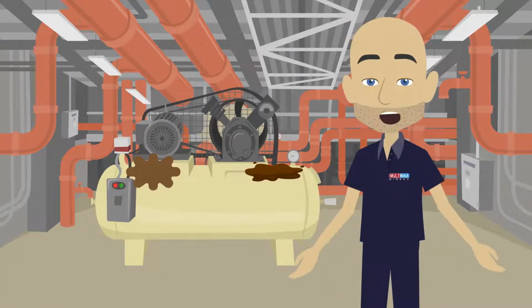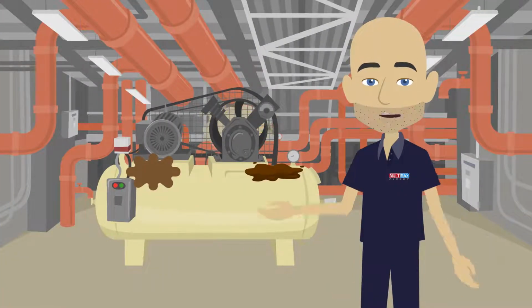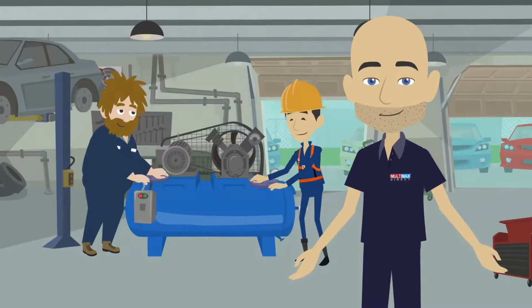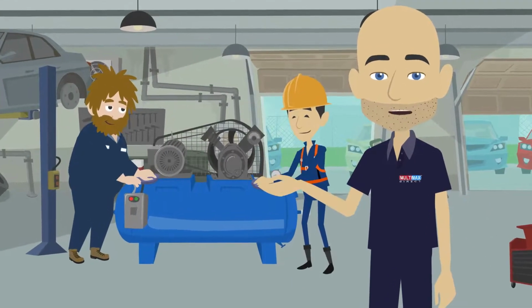3. Clean the air compressor's intakes. Most industrial and many commercial or hobby uses of a compressor involve dust and dirt. These can accumulate in the air vents and restrict airflow into the compressor. Clean them on every inspection with a brush or rag.